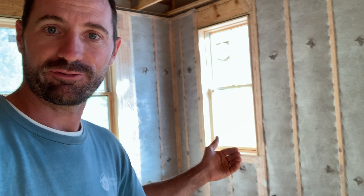A good alternative is to frame your walls with 2x6s instead of 2x4s to get a 50% thicker wall and more space for insulation. And then better yet, fill it with dense-packed cellulose. To do that, we staple a breathable fabric over the 2x6 stud walls and pack cellulose fibers — basically recycled paper shreds — into the wall with a heavy-duty blower. The dense-packed cellulose will eliminate any air gaps and provide a better insulated wall than fiberglass, mostly because there's no space for air leakage. The problem is that it's time-consuming and expensive — it literally triples the cost of insulating your home.